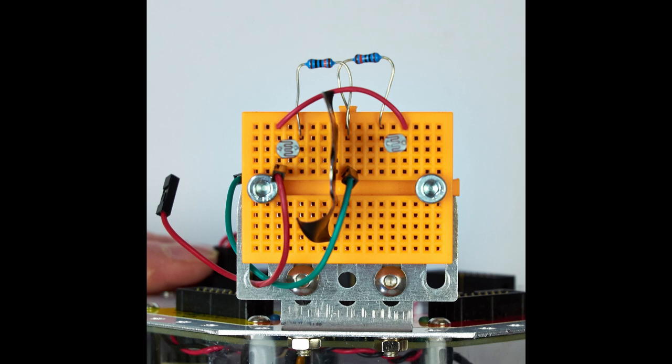It's now time to connect the three volt and the ground wires to the breadboard. The red three volt wire goes to the left of the two LDRs and is in the same row as the upper power wire and the left hand LDR. Connect it as shown in the picture. Thread the spare end of the wire through the holes as shown.